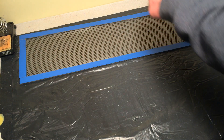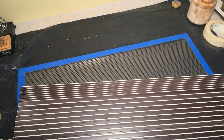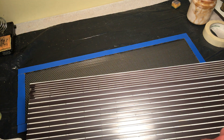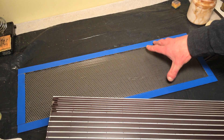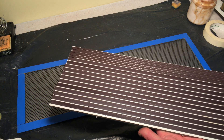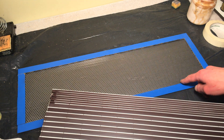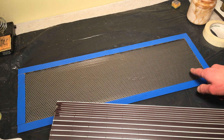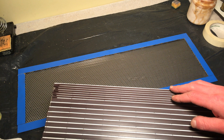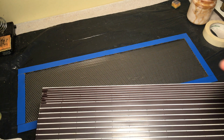The next step is quite easy — we're gonna drop it in. I'll keep the tweeter panel as reference, so this side is gonna be against one of the spacers. There's some space left on this side, which is good because this is gonna be the midrange. Very close to the edge of the spacers it's hard to get any midrange — it'll be mostly high frequencies. For the midrange I'd rather have a little more motion if possible.